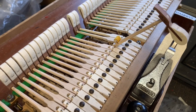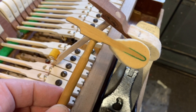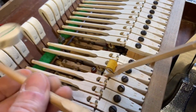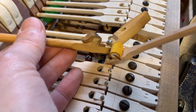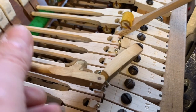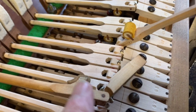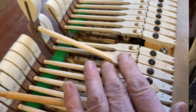Here's a new set of hammers on a Bechstein for comparison — you can see how much the Bluthner's has been refaced. The Bechstein measures approximately seven millimetres; these are new Renner hammers. If you look at the roller, compare that with what the Bluthner has at the moment. Bluthner chose that design and it's good, but changing to a normal roller is easier to fit. As long as we measure correctly from where the jack is to the centre pin — I've spoken to a technician about it and he's confident. We've done these before, and a normal roller feels a bit smoother.